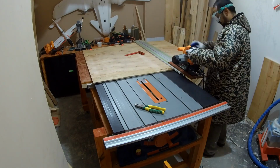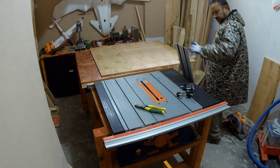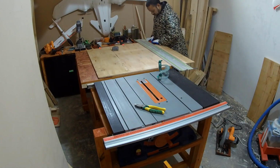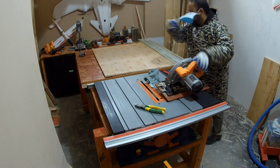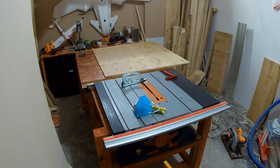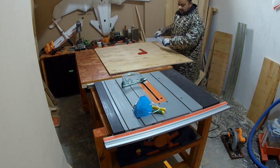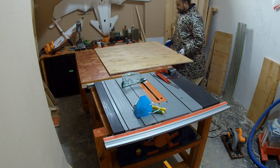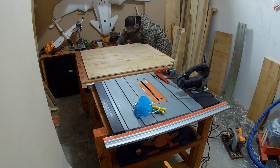After that, I use my new favorite cheap jig to cut another piece of plywood. This is the same thing that came out of the 100% pallet wood table that we salvaged from, and this one will go and form the base level. After this cutting, I went ahead with my jigsaw. I measured the thickness measurements of each leg, and I used the jigsaw to cut those squares.